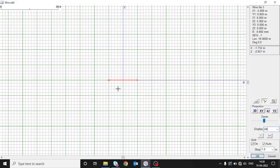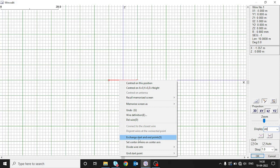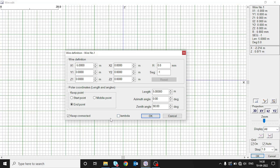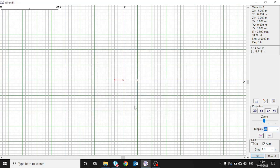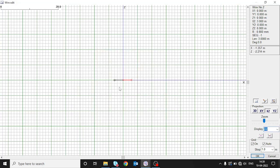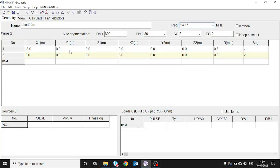The dipole needs to be in two parts, so I'm going to right-click on it and divide the wire into two pieces. Now we need to assign a length to each element, so we go to wire definition. We'll shorten this antenna by 40%, making it 6 meters total — 3 meters on each side. Each element length will be 3 meters. I select the other element, right-click, go to wire definition, and make that 3 meters as well.